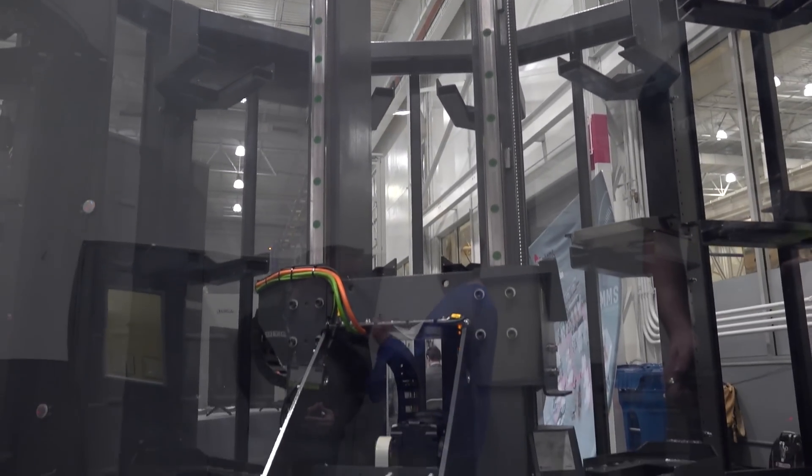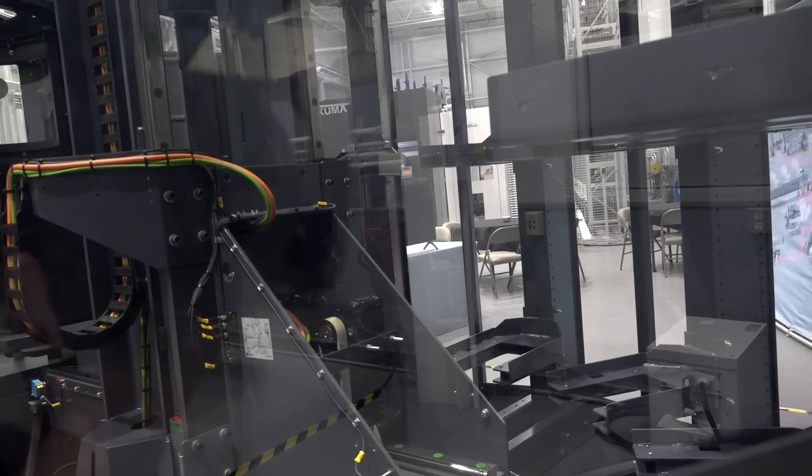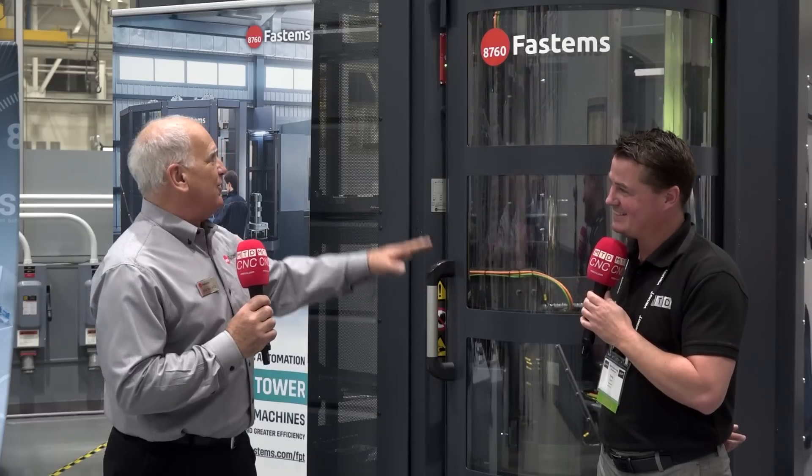What we're trying to do here is do the right thing at the right time, all the time. At the end of the day, you have a beautiful machine tool over there with a spindle utilization in maybe the 30% to 40% range. What we're trying to do is really double that — by taking the operator and putting him in the right place at the right time, not having to hunt around for tools, fixtures, or parts. Everything is here; we store our fixtures here, and now we give that machine the capability of running in the 80% spindle utilization.